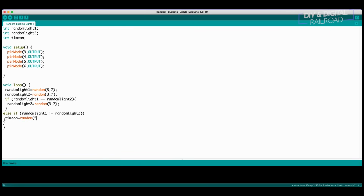So let's say you wanted it to be between 2 and 3 minutes. 2 minutes is 120 seconds, so that's 120,000 milliseconds. So you do 120,000. And 3 minutes is 180 seconds, so 180,000 milliseconds. So you do 180,000, and that would be your number. But for this demonstration, I'm going to keep the 500 to 5,000, and that's going to be our decider.